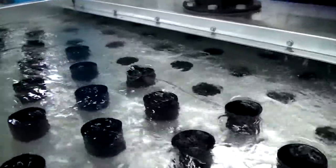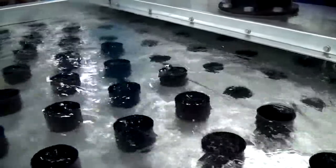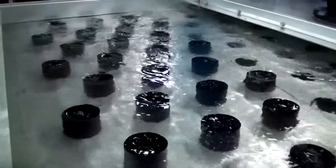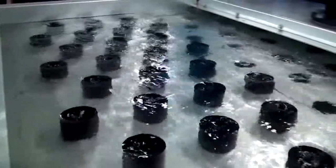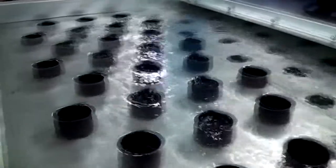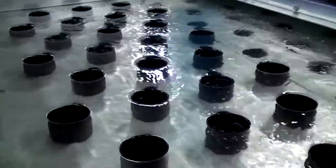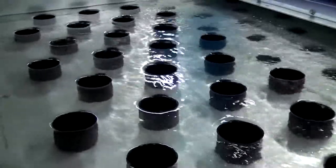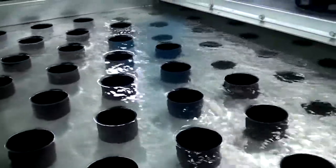This is at about 100% design flow, so we're at about 3 inches of head over the nozzle. Now as we turn down the flow rate, what happens is the water starts gradually not flowing into those nozzle cups, to a point where the water is only diverted to the louver face and the nozzles that are not using nozzle cups.